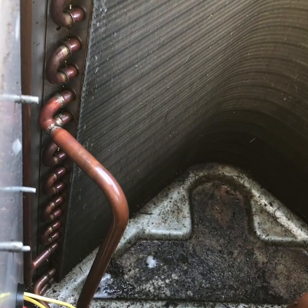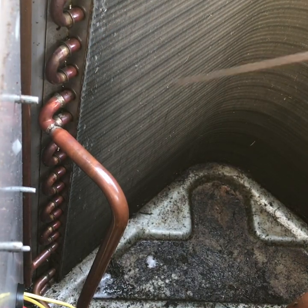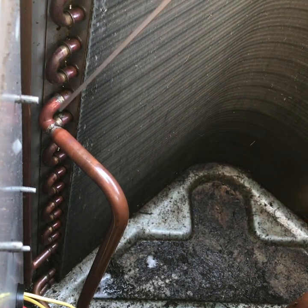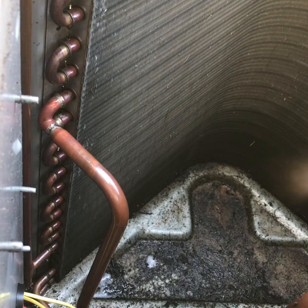I'm draining the nitrogen back out of it, then I'm going to get this welded up, pressure test it, pull a good vacuum, then add about four pounds of refrigerant. When soldering any of these types of loops, you always want to run really low heat on your torch. If your torch is too high you're going to blow holes through the whole thing and it's going to be a disaster, so make sure you have lower heat when doing this type of solder.